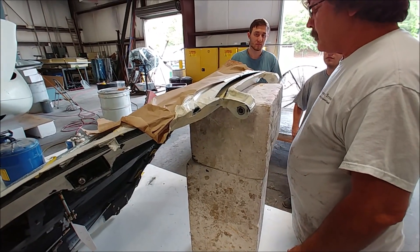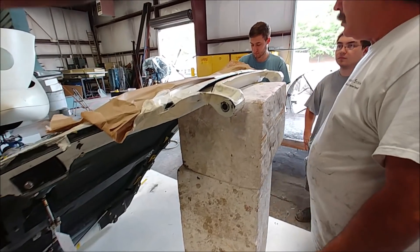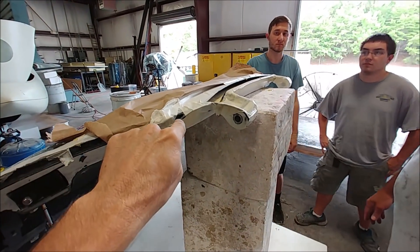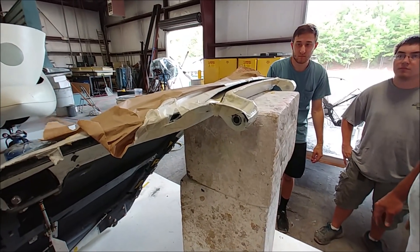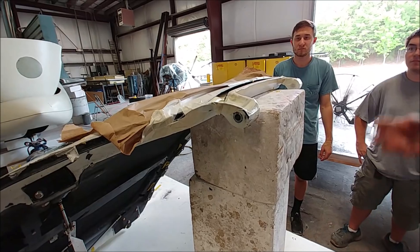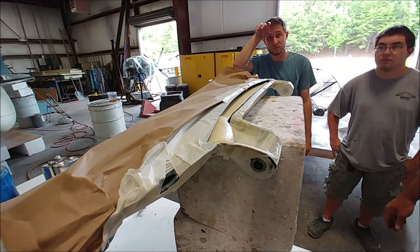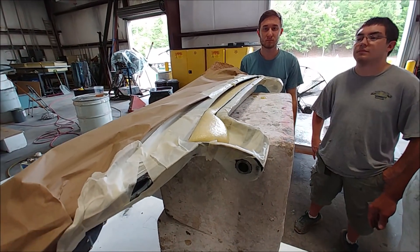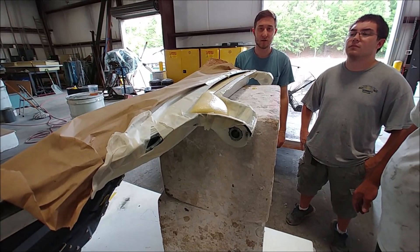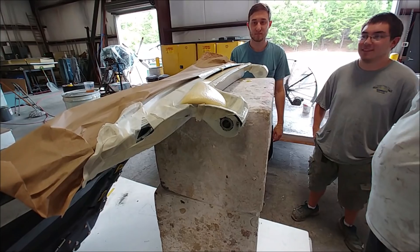Back on the doors — here's Jeff setting up and pouring some expanding foam into the very top frame of the doors, just to give it a little bit more structure and rigidity. You can see it starting to flow out the top. We're basically filling up that top channel, which is why I put those fences in the frames — to allow us to do this without the foam going all the way down into the rest of the frame, since we don't really need it there.